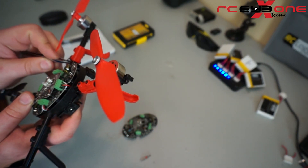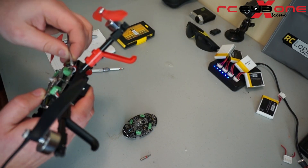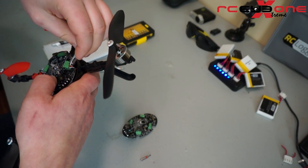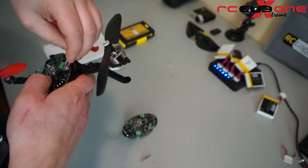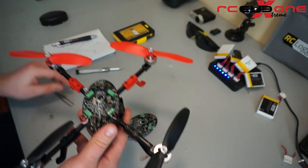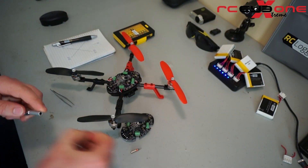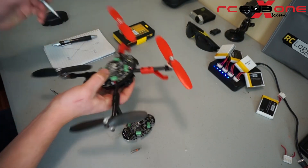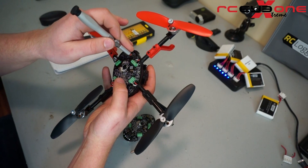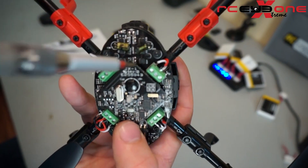Move them out of the way a little bit. Obviously make sure you don't have a battery plugged in at this point — if you do, you probably shouldn't be doing this in the first place because it's not safe. Pull my wires away, and the next thing I need to do is drop the battery tray. The battery tray itself is mounted to the flight control board, so I'm going to switch my bit. There are a total of eight screws on this flight control board — the smaller four screws are the ones that hold the battery tray in. They are the closest to the center of the flight control board.